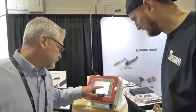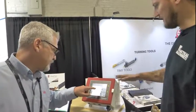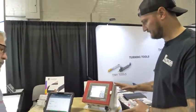This mounts right on the machine itself. All we need is a couple of very simple signals — a signal when the machine is running, and if you're making piece parts, a signal when the machine completes a part. That way we can track uptime and downtime and also measure production rates.